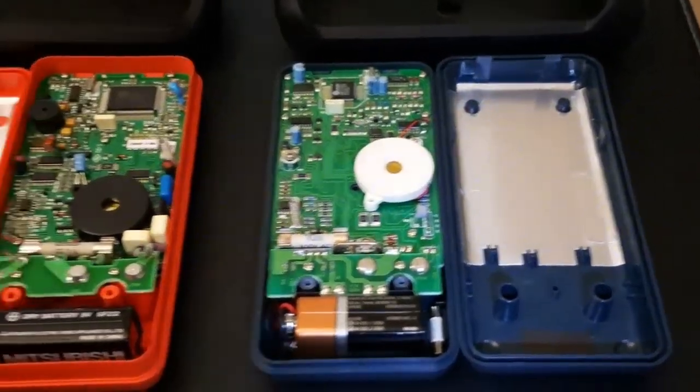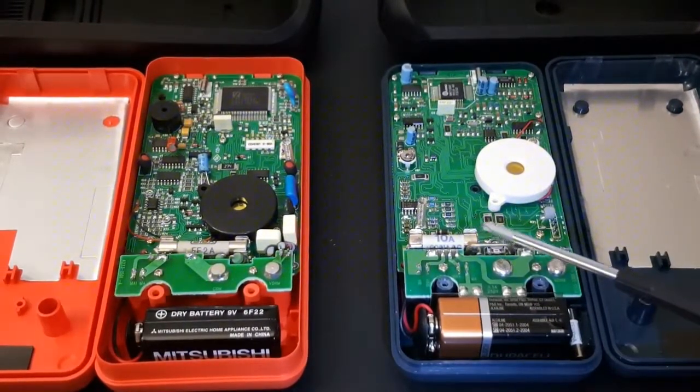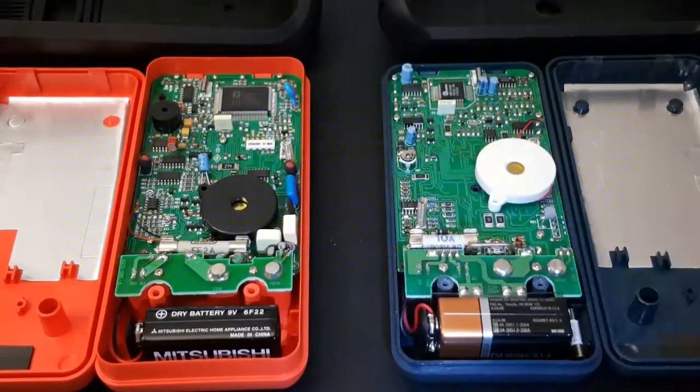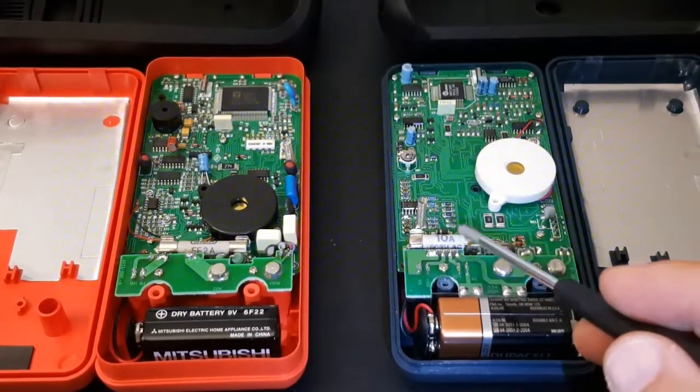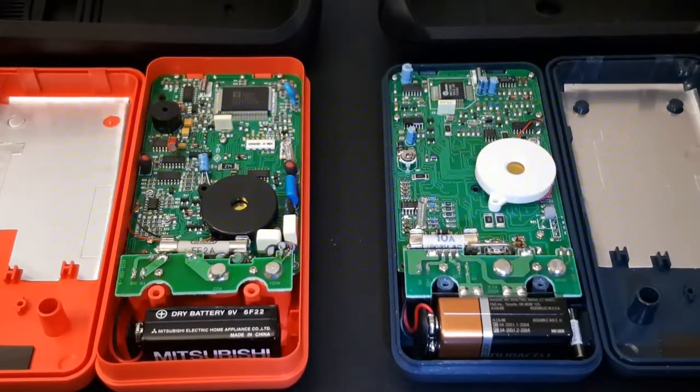And we'll just pan back here again, look at them both. So once again, you've got the 10 amp, 600 volt fuse here on the Wavetek, compared to the 2 amp, 1000 volt here. They do have different chipsets entirely, and I'll pull up the specs and put those online. Overall, I would have to give my kudos to the Wavetek in terms of the overall design and cleanliness.